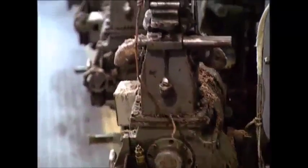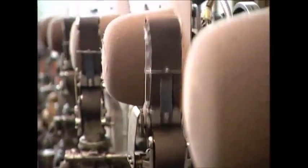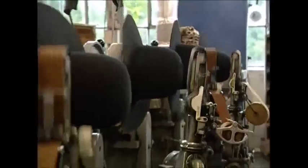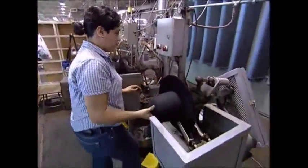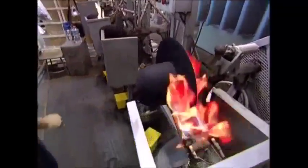Although they work in a tough environment, the traditional cowboy hat has a soft velvety texture to it. Freshly made hats are being sanded down — the production processes have roughened the material, so the sanders are used to produce a soft and delicate texture. The only downside is that the sanders leave small felt balls on the hat's surface, but these can be removed easily with fire.